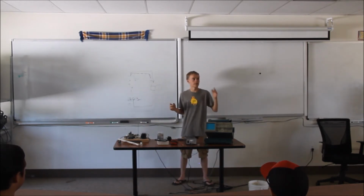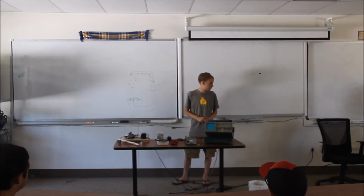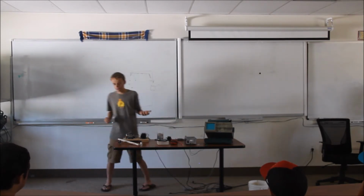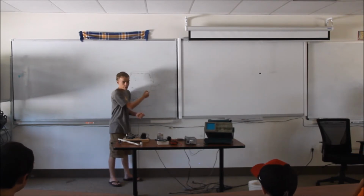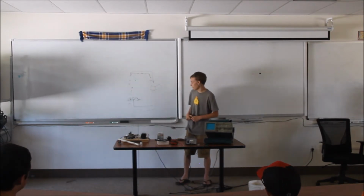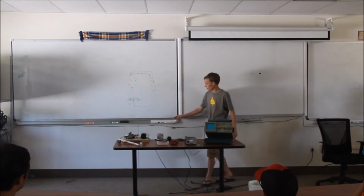Like, you know how you see light bulbs, and some of them say 60 watts, some of them say 30 watts. Well, those light bulbs still use the same 120 volts source, but they use different amounts of current. So one light bulb that's running off the wall, the 60 watt light bulb, is going to have a lot more electrons flowing through it at one time than the 30 watt light bulb. And we can kind of figure this out using something called Ohm's Law. But I'm going to get into that after I explain alternating current.